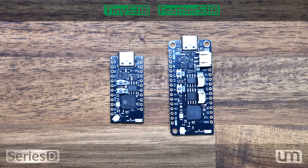The Feather S3D has not changed in size at all, but a few things have been rearranged on the board. There's the onboard antenna, the UFL connector, and the RF switch in the middle. The mounting hole was on the other side but is now moved over to fit the RF layout in. One of the Stemma QT connectors was at the end, but they're both vertical connectors now, giving you LDO1 and LDO2, or I2C bus 1 and I2C bus 2. It has a new battery charge IC, I2C fuel gauge, and also has the 1x1mm RGB LED. Otherwise everything's the same.